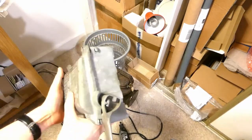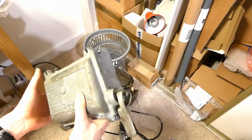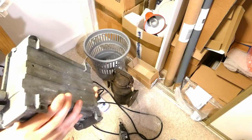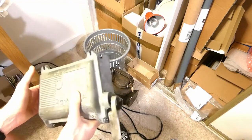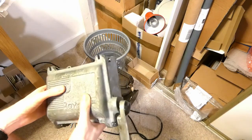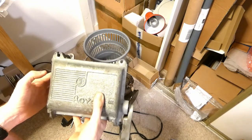dismantled pretty much everything, gone through all of it, removed any old insulation that looked worn at all, replaced that, and then added a load more on top of that. I've since buzzed through it with a multimeter, and I'll do that again before I actually turn anything on, just to make sure nothing is going live that shouldn't be going live. Again, get someone competent to do this. Don't try and do it yourself if you're not comfortable doing mains work.